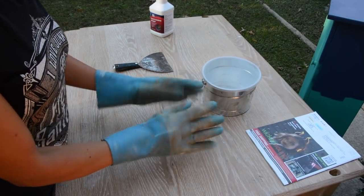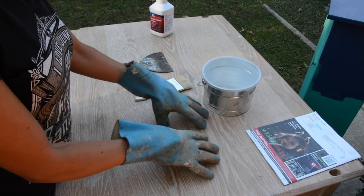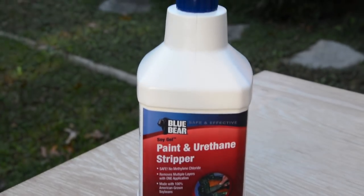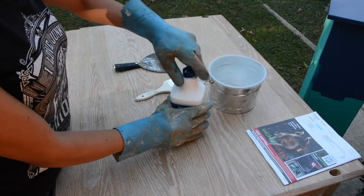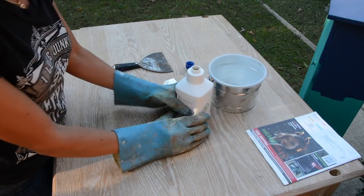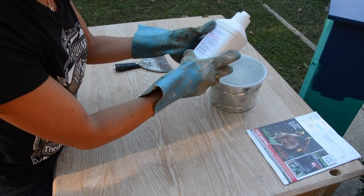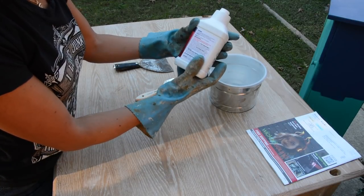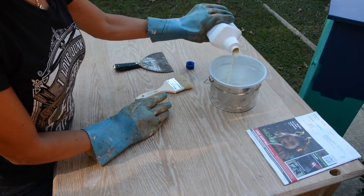So let's go outside now. We are going to do a demonstration: is there a way to strip Annie Sloan chalk paint so that if you decide you want to strip something back to its natural wood, how easy or difficult will that be? When I'm stripping paint from furniture, I always use chemically resistant gloves. I like to use Blue Bear — it's a little safer, it doesn't have any methylene chloride, and it is made with soybeans. One thing I noticed is that it doesn't have the same kind of stinky odor that some of the other strippers do. It's pretty mild actually. This was $22.99 — I got it from a woodworking store and the online price is comparable.